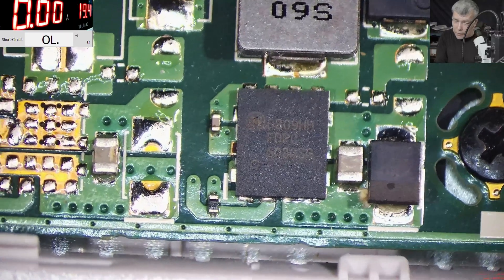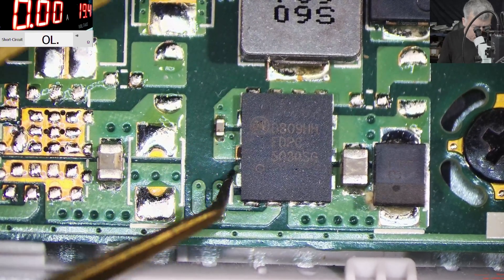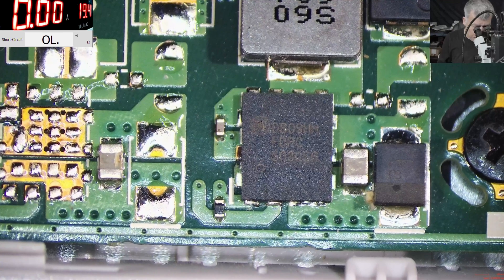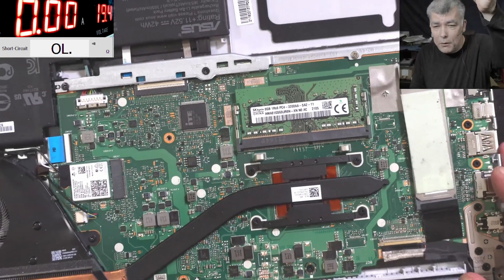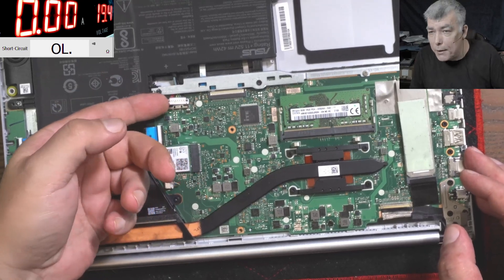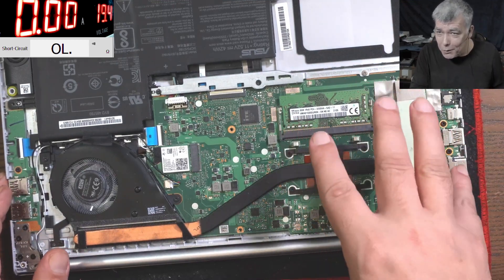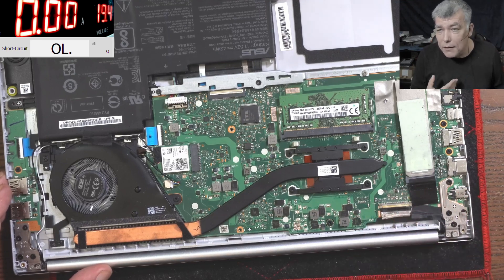You know what - it's probably like that from the factory, because I can't see any flux. So indeed it is bent a little bit. You can see by the space here and here - it's angled. So no one actually played with this MOSFET. Now, if the customer is lucky we can have a shorted capacitor. If the customer is unlucky - and most likely with these VivoBooks with shorted MOSFETs, you'll remember - then it's a shorted MOSFET and a dead CPU.